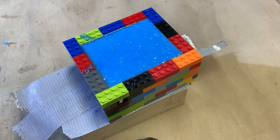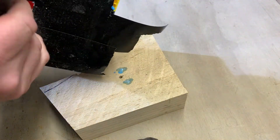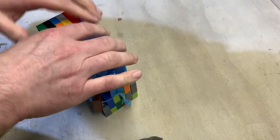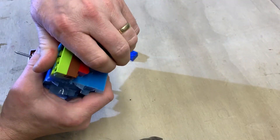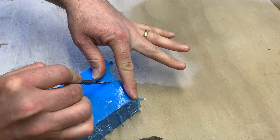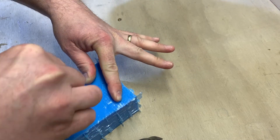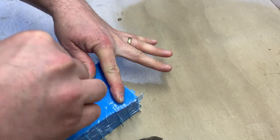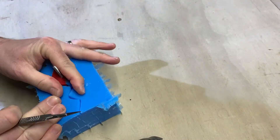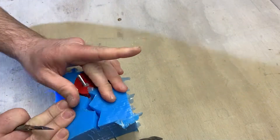When the silicone is cured, unbox the mould. This next part is the tricky bit. Using a scalpel or an exacto knife I slice into the silicone using a zig zag cut, being careful not to cut into the master underneath. Wherever possible put your cut lines on the back or the sides so that they're the least visible on your castings.